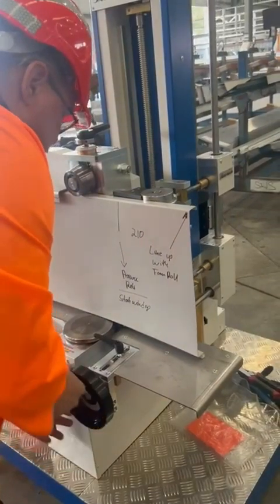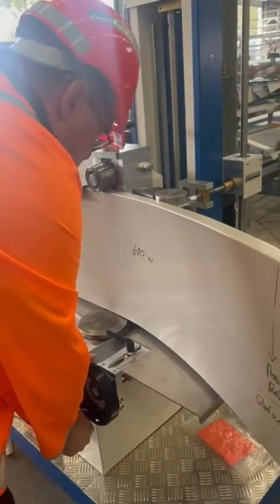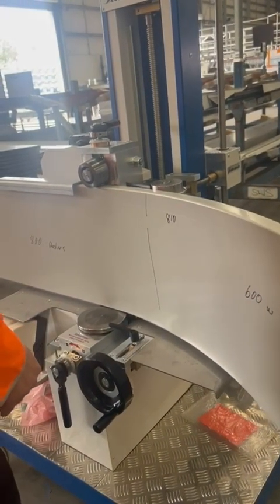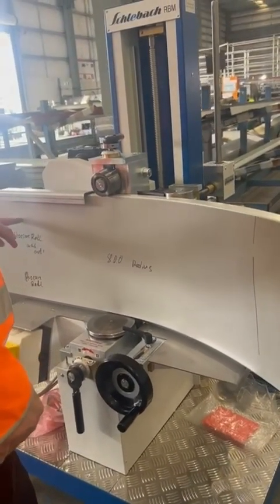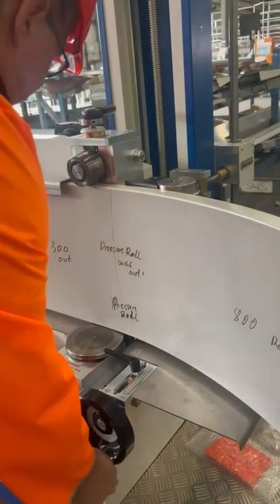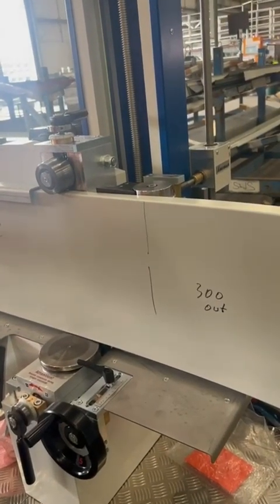You can see I'm straight away winding it in — I don't hesitate. I have my radius a little bit early, but we'll chop off the rest of the piece and be happy. Here comes the first 800 radius. Remember, when this passes the pressure roll I have to be ready to wind out — so over the 300 millimeters I release the pressure. I'm clear.